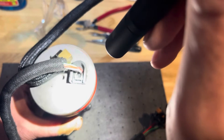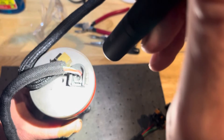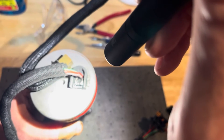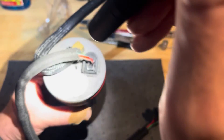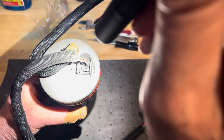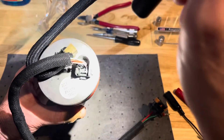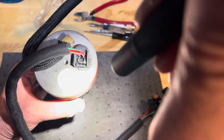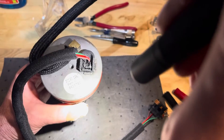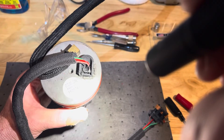What we're going to do is cut this diode out and repeat our test to see if we can get the pump to run, which I suspect that we will. Then we're going to put the diode further up into the harness where it's more easily accessible. You can see the wires going in — this is all filled with epoxy. I'll put some still pictures in there. There's a diode right there on the bottom — you can see a good look at that. So we're going to go ahead and cut that out and then we'll come back.